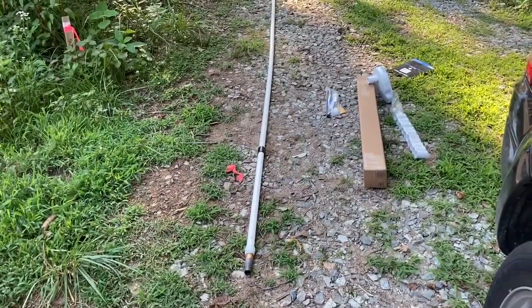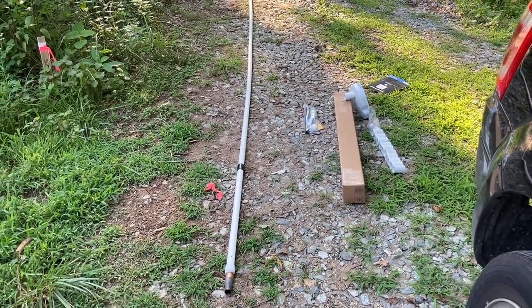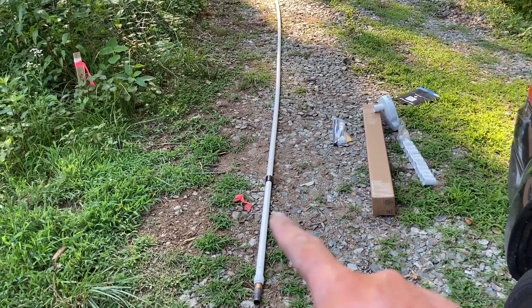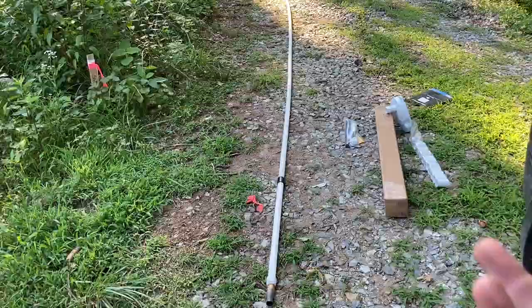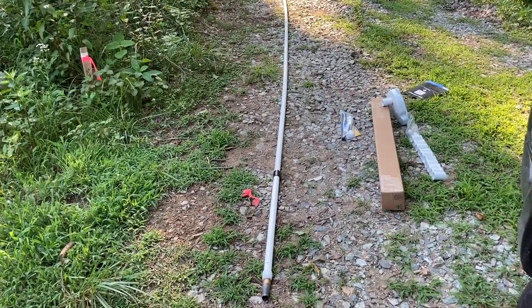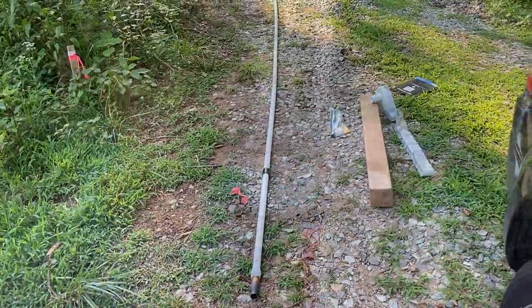While I'm letting the cement dry, I'm going to tie my string to the piston here, so if something happens and I drop the whole assembly, I can still retrieve it — just a good safety measure. My bride is here and she's going to help me lower the pump down into the well. They recommend having two people; it makes it a lot easier, so we'll slowly put it in.